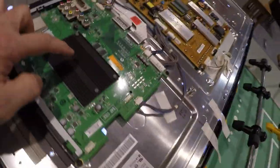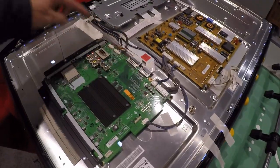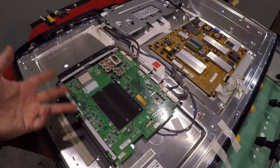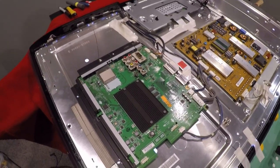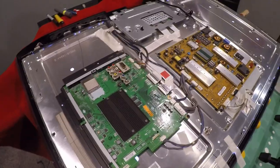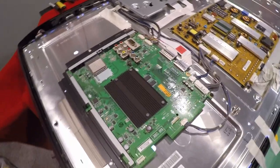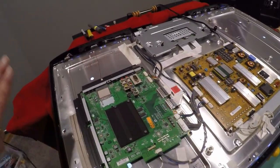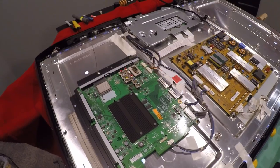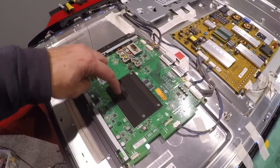All I had to do was reflow that main video control processor underneath this big heat sink right here. I've seen things on eBay where they say you could take all the connectors off and put the whole board in the oven at 350 degrees for about 10 minutes. Personally, I do not think that's a good idea, because you've got lots of plastic parts on here that may not enjoy being at 350 degrees. I saw a video of a board that was warped like a big C shape — I think before it got sent in for repair, someone had put it in the oven and it warped like that. So it's better to just reflow and heat up that one chip.